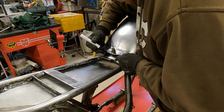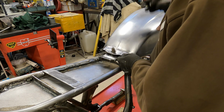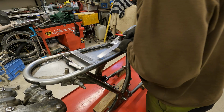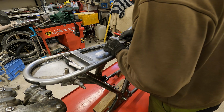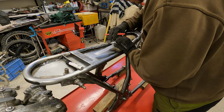First, I place the tank in its own place and mark the place at the back of the tank's old mounting bracket. After that, I mark the center guidelines. I cut off the strip from the middle, because the future tank mounting bracket has a small rise at the bottom that is perfect for centering. After cutting, I put the tank back so that I can mark the center of the mounting hole in the tank.